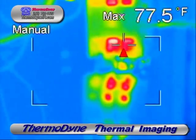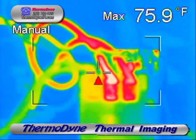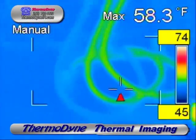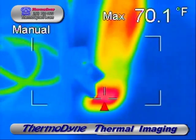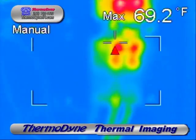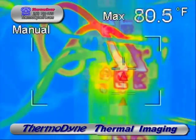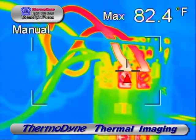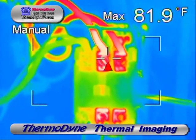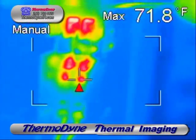Here's a curious electrical anomaly that the maintenance department can look into. This is driving a three-phase motor, and there's no other load, yet two terminals and two wires are drawing more power than the other one. This is an electrical anomaly that would otherwise have gone unnoticed and could be a potential future problem. And this is what predictive maintenance is all about.